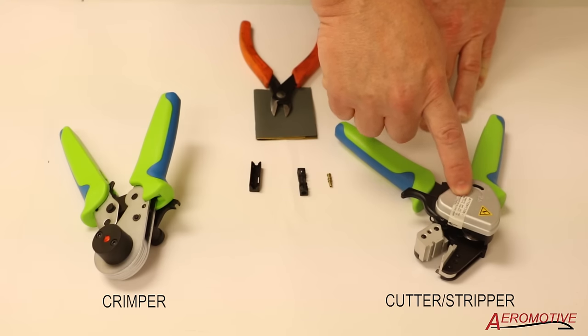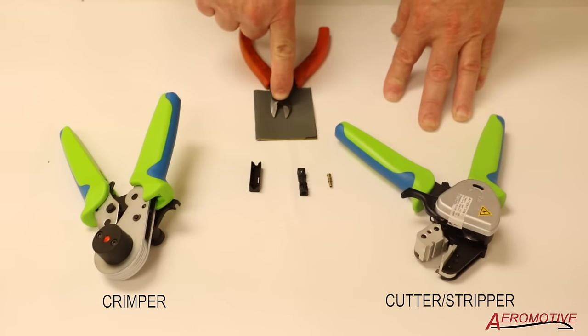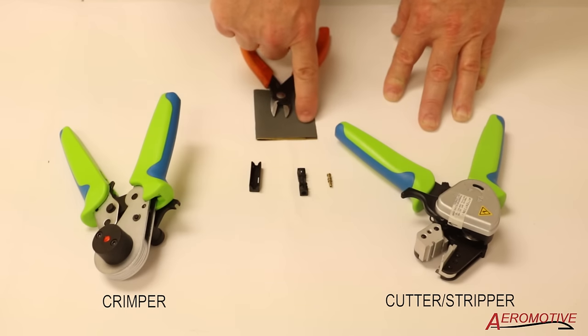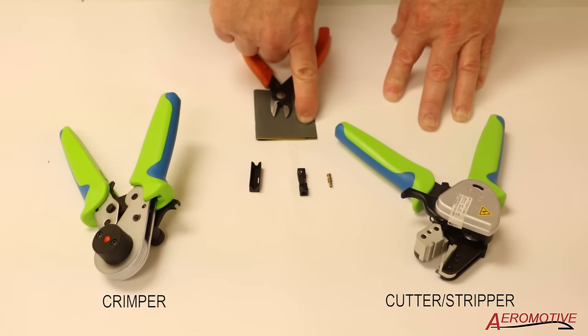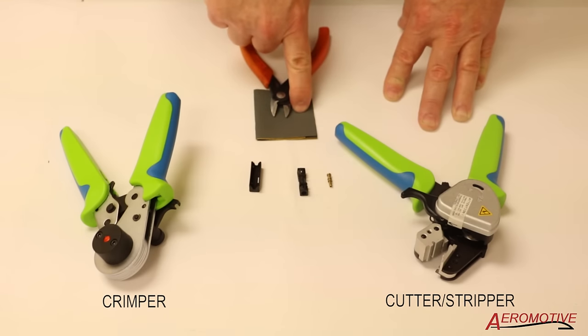The reason why we need a clean cut is because diagonal cutters will create a wedge or point on the fiber optic cable. If you create a wedge or point, you're going to need to sand down the end of the fiber optic. It's like shining a flashlight through water — it'll just disperse all the light and you'll receive a poor quality transmission.